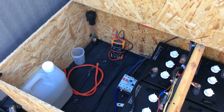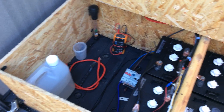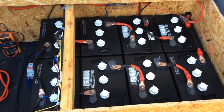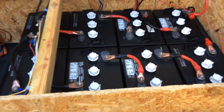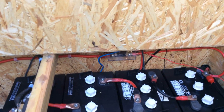I've got some testing equipment and I do test my batteries on a regular basis, top them up, and equalise them every six months. I've had this running for the last four years and I've had no problems whatsoever. Under the bottom here I've also got another 60-amp fuse so everything is fused properly.